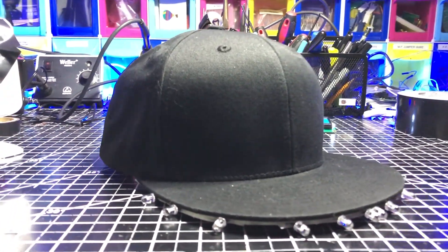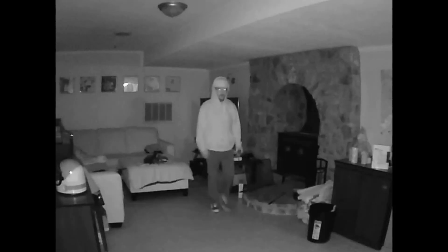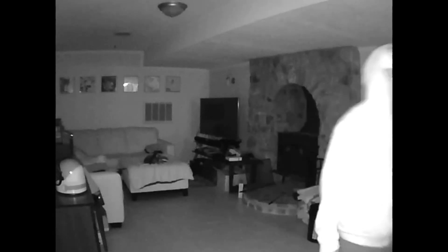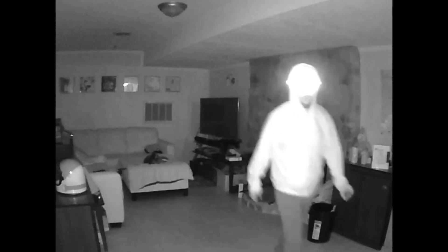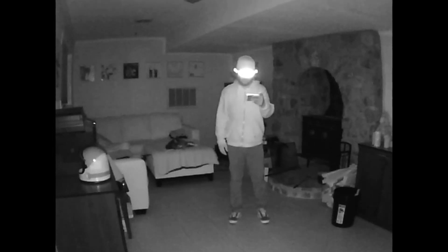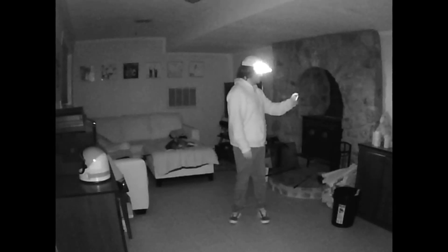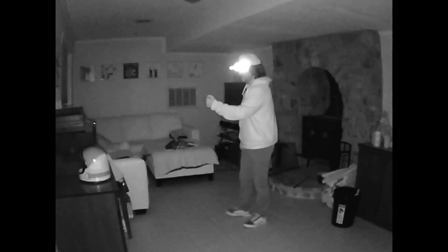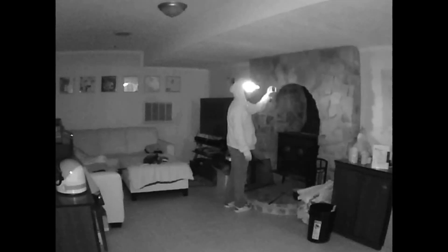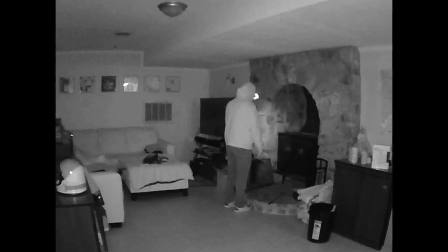The MacGyver inspired camera blocking hat is now complete and we're ready for full-scale testing. I'm using a D-Link 5010L mounted to a tripod in my living room. Here's a shot of me walking with the hat powered off, and now here's a shot with the hat powered on. Now I'm going to test the 180-degree feature. I put on the hat and look forward — I have more LEDs pointed forward so that's where it's most effective, but it also works great on the sides. I turn to my left — it looks good. And then I turn to my right — looks good here as well. I noticed that the MacGyver hat also makes a great infrared headlamp. What do you think? Anything that can be improved? And if you like these hacks, subscribe for more.